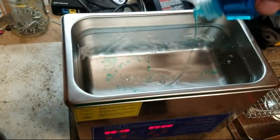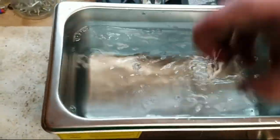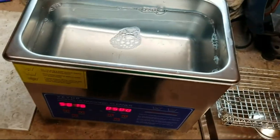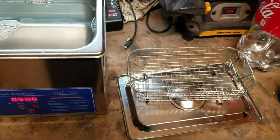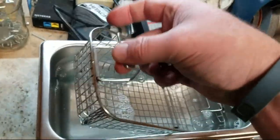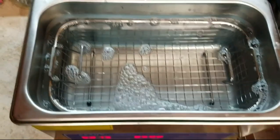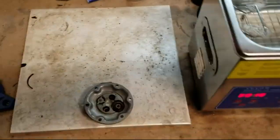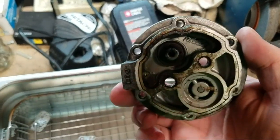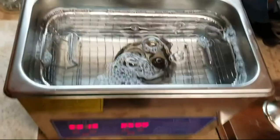Let's take a whack at it anyway. We'll add just a little bit of dish soap here. It does come with a nice little basket — that's a nice touch — and a lid, which is good. If you've got the heater going, you will evaporate whatever you're cleaning with pretty quickly, so the lid is a nice touch. The basket has convenient little handles for getting it back out, and little rubber pads on the feet so it doesn't scratch up the bottom of the tank. We're going to clean a part from an old mechanical fuel pump off an old truck I had — it's gross and dirty.